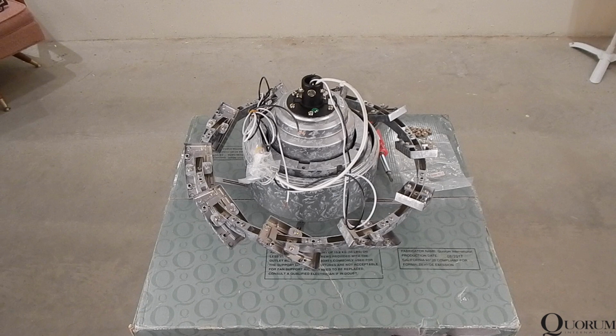For any of the larger sizes, you'll want to put on the downrod and related components at this point, as it will be difficult to reach the center of the fan after the blades go on. I put off doing so for my fan because I didn't want the canopy rattling around while I worked with the blades, and I knew that I could reach to put it on afterward.